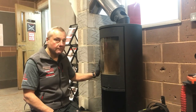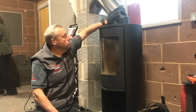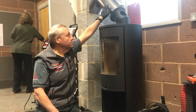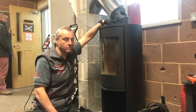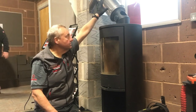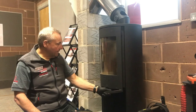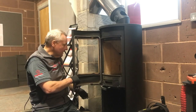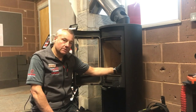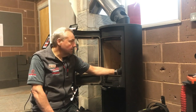You'll notice that the glass is rounded and it sits on a pedestal. At the top there's a short vitreous section with an inspection plate — normally the twin wall would come straight into the top of the woodburner, but this is for training purposes. When we get the camera inside you'll notice that all of the fire bricks are vermiculite, shaped specifically to fit this stove — I suspect they cost a lot of money.